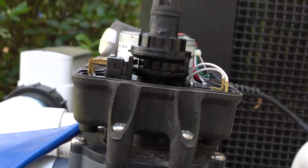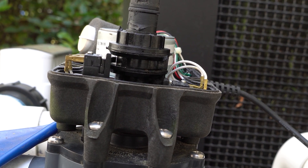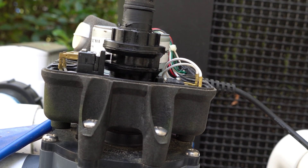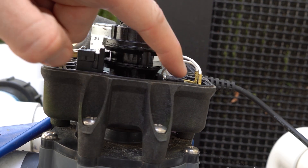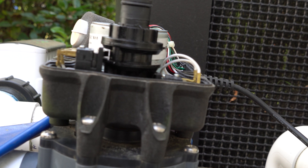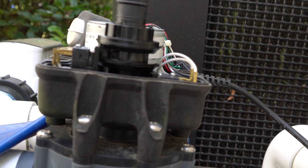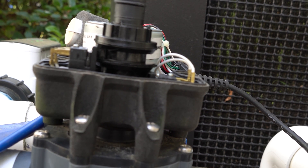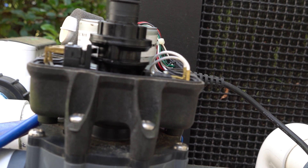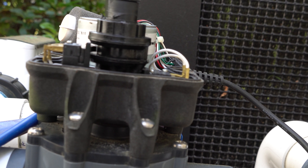Double check our work — let's get a good look at the actual mechanism. Here are the two limit switches, one on each side. You can see that when these little nubs go around, this one pushes on this side and this one pushes on the other side. Now that we've fixed our limit switches, you can see that when this one gets depressed it stops the valve and puts it into the position returning to the pool, and when it goes back the other way the bottom one actuates the lever and we're back to the hot tub return.